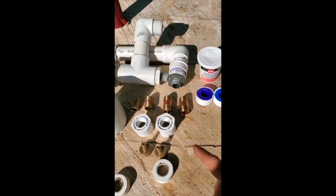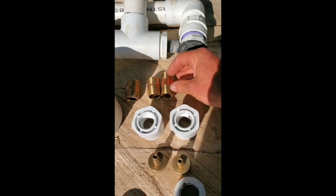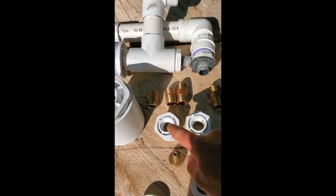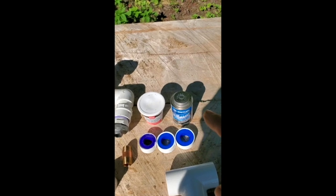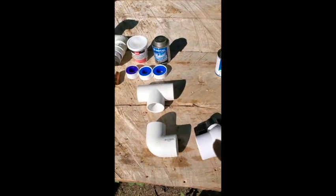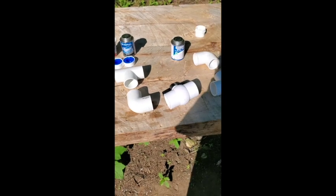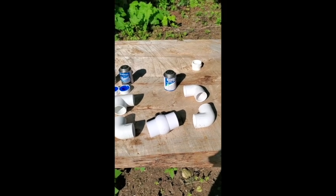As far as the nozzles, I bought two different size bushings this time, hoping that the longer threads will engage those nozzles and we won't have to add an extra gasket inside. We still have our gaskets, but now we also have plumber's putty, pipe dope, lots of thread tape, and all our connections are going to be slip fit connections that glue together. We're going to replace the threaded ball valve with a slip ball valve so we can glue it so it doesn't leak.